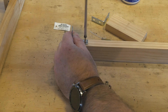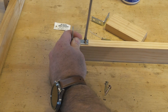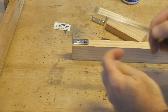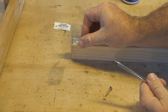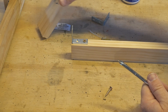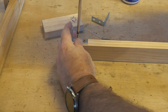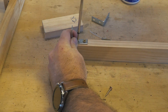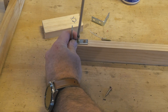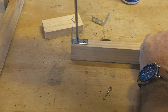It's ideal not to use nails — don't use nails in this particular part of the build, you need to use a screw. I bought a box of 100 for five dollars. I'm checking the wood to make sure it's nice and straight, then putting the second screw in to secure it. In this video I'm not going to spend a lot of time showing over and over how to screw in brackets — once I've shown you once, that should be enough. We'll focus on where the pieces of wood go and what we're measuring from to keep the box nice and square.